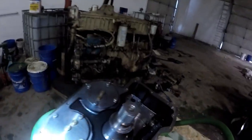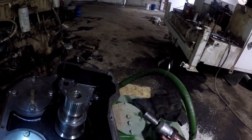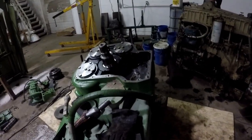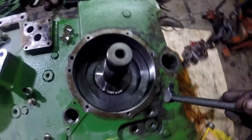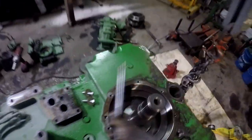So now I think we're ready to flip it back over and then we separate the case on it now. So we got her flopped over. I brought my bar over here to show you guys. The park brake spacer - I already popped it loose with the heel bar, but just take your heel bar down in here below it and pop that loose.